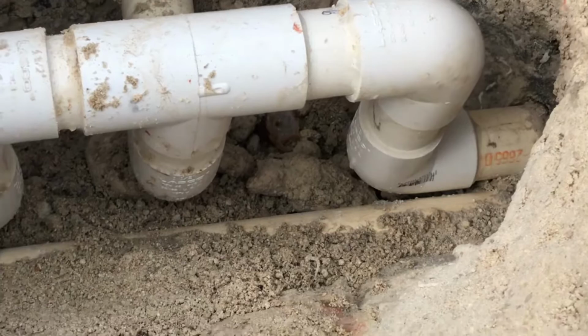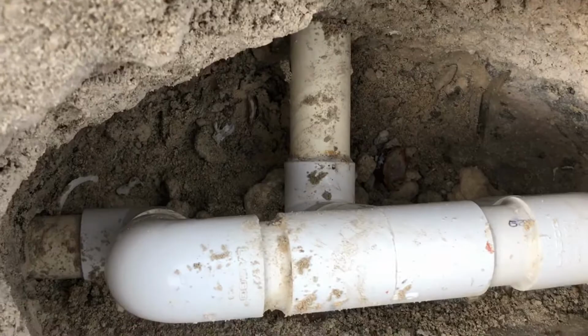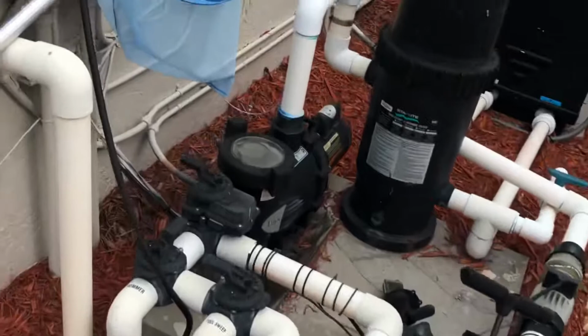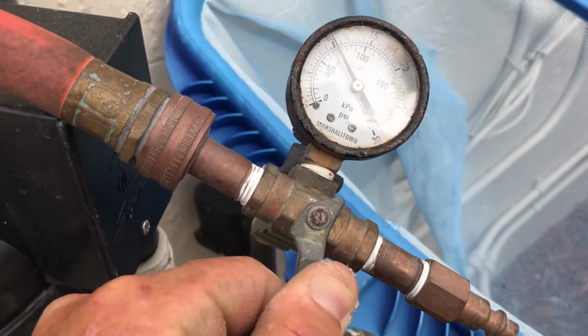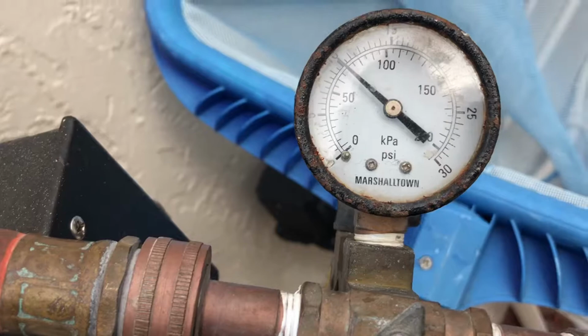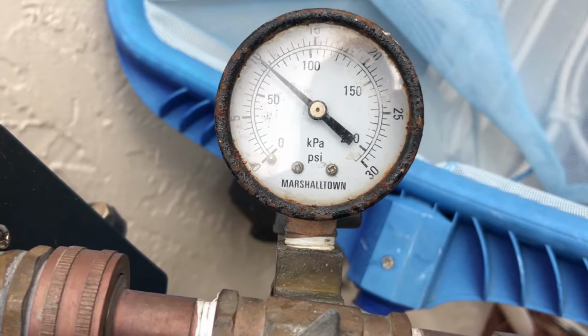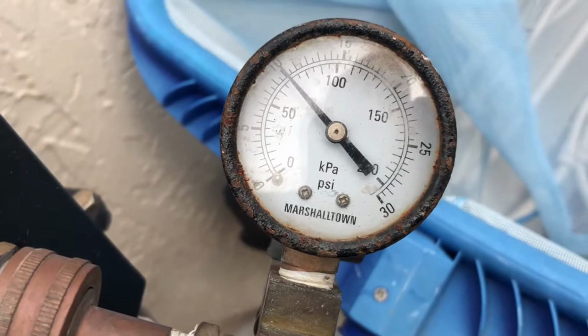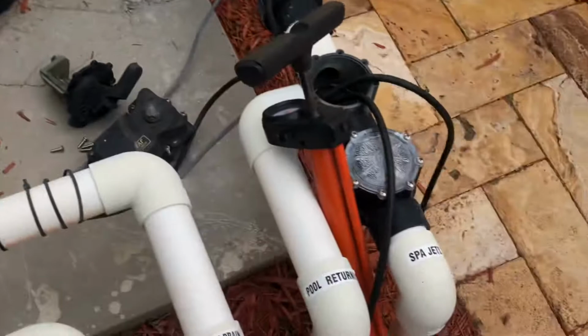Everything's looking perfect. All right, let's go back. Right there, 10 pounds. All right, she's holding. This tells us this is a positive static test. We're holding 10 PSI within the whole entire plumbing of the pool returns. So now, since we're holding and everything looks all good,